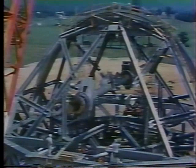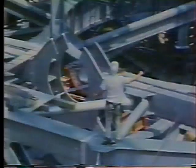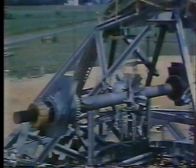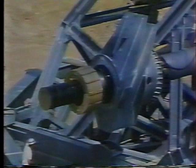On hand at last, it was snaked under the erected gear girder and fitted into place. The declination shaft is one of the most complex sub-assemblies in the telescope. Its aluminum shell is adjustable about a steel central shaft; the quill assembly allows the antenna system to be precisely adjusted to the true declination axis, which is adjustable so as to bring it precisely perpendicular to the polar axis.